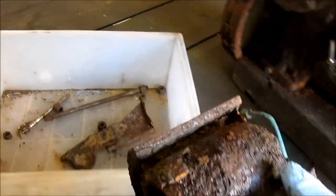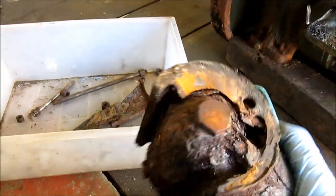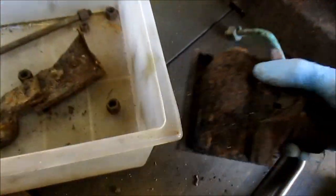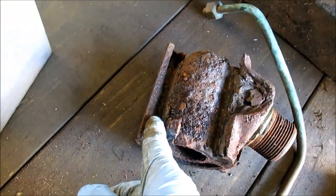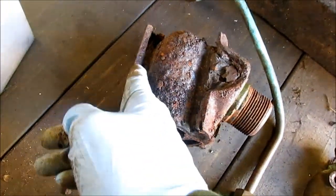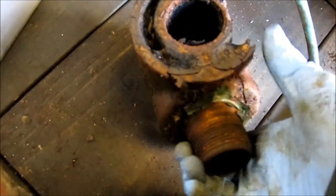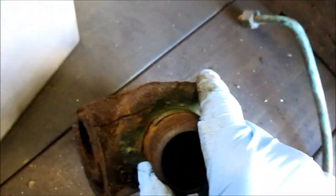As you can see, we have trouble — this engine is so severely frost damaged. Here's the exhaust outlet for the engine, threaded on there. This void here is meant to be a water jacket with the outer casing, but you can see it's full of crud and it's had frost damage or rust at some time, as you can see — so that there is well knackered, to be honest.